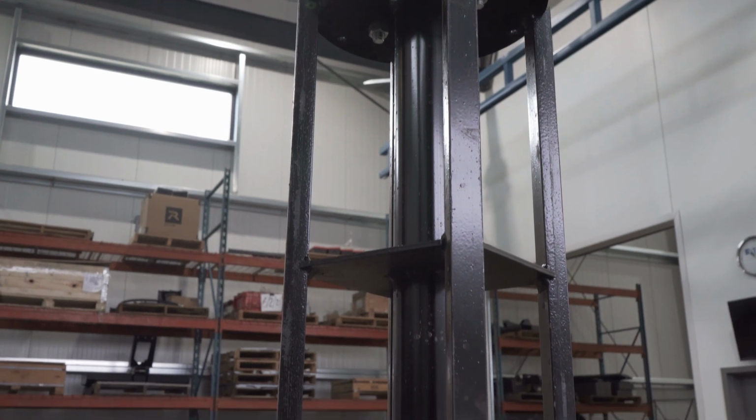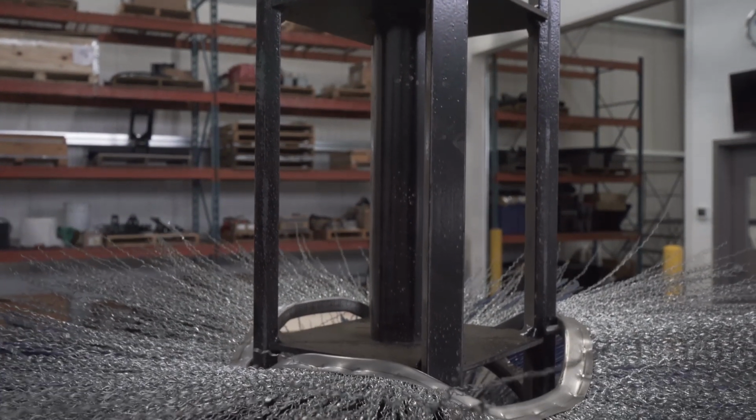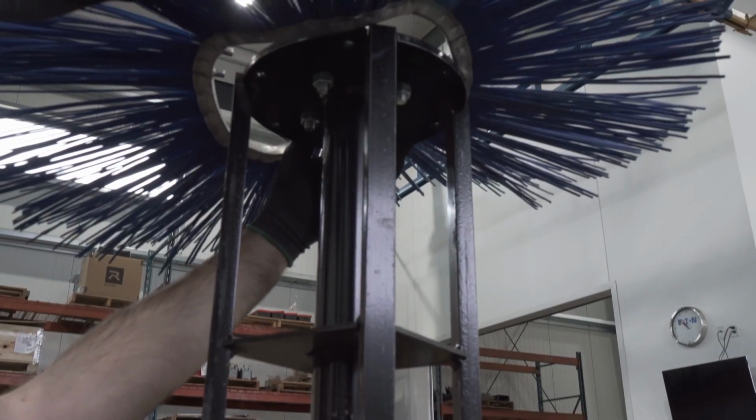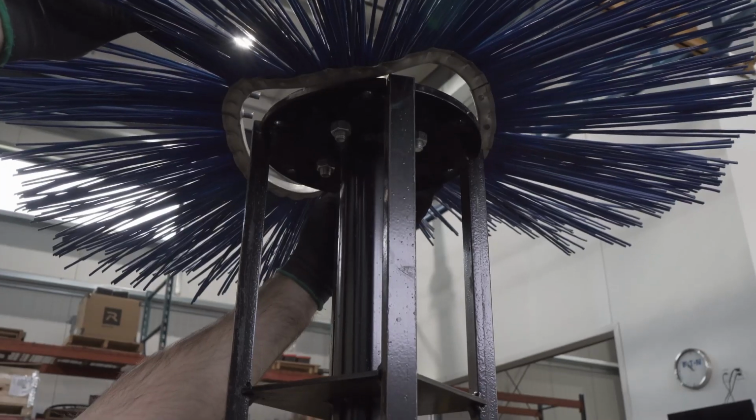Inspect the dry bars for indentations or excessive wear. Replace or repair the core if damage is present. Slide the first wafer onto the core, making sure the wafer pins are on each side of the core bar.